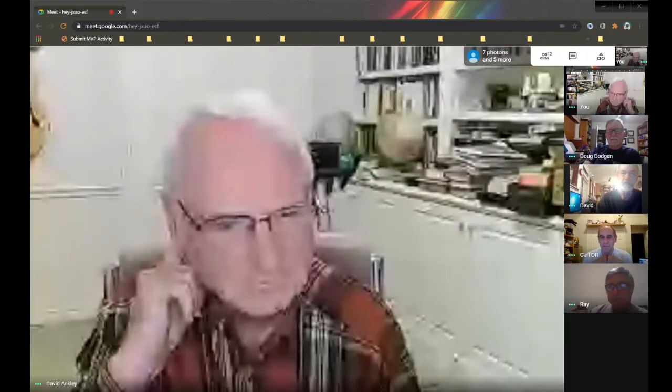Given that, my default is I just fall back on a serial interface. They're easy to use. You can talk ASCII across them, so they're easy to debug. They can run really fast these days. They're bidirectional. It's just real hard to beat. It's just old-fashioned, 3 wires, right?